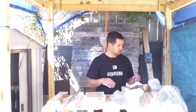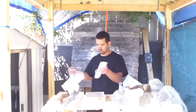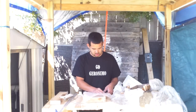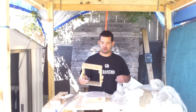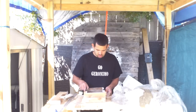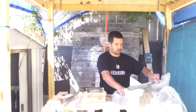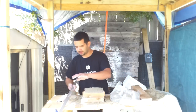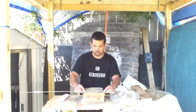A lot of people use some talc, but I just use wax paper. Throw that over the top, put your other side on, and we'll start filling it up with sand on this side and start packing it down. Then we'll shave off the excess sand over the top again.